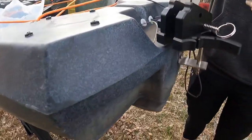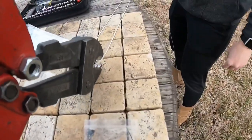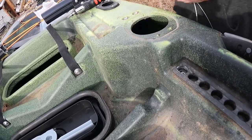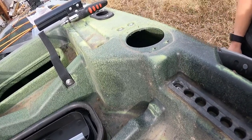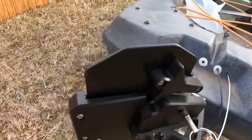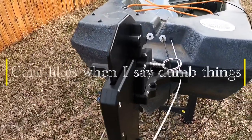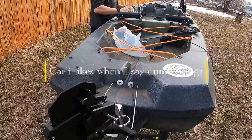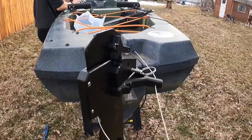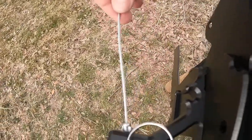For this next section we needed to reattach the steering to the rudder. What we did was purchase 13 feet of cable — it was one sixteenth inch thick — and we also needed three cable stops. We put one cable stop dead center of the 13 feet of cable, and that's where you tighten down the steering control knob onto the cable so it doesn't slip. Getting that nice and snug, got one side clamped down.